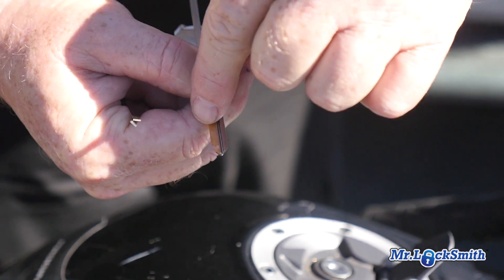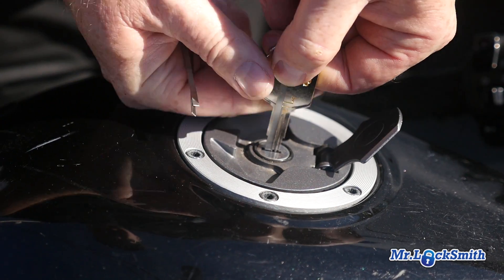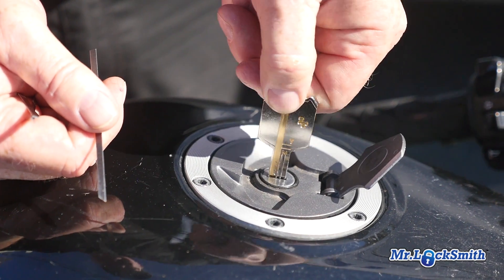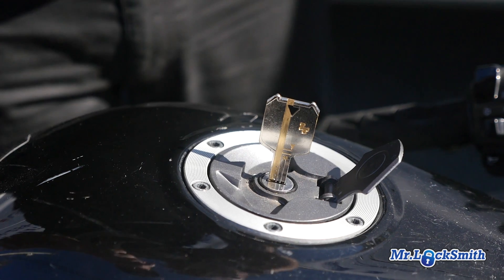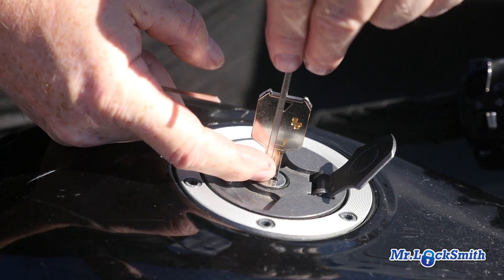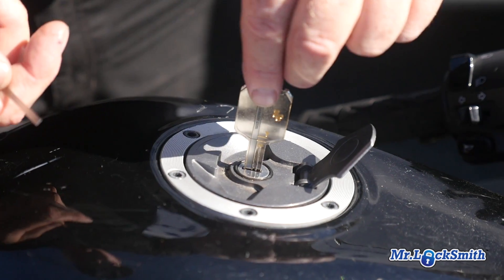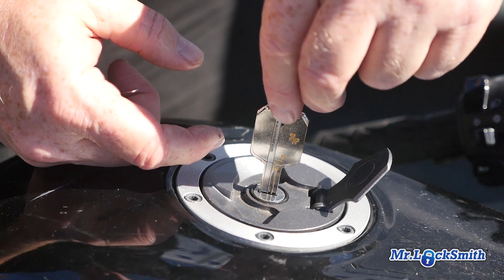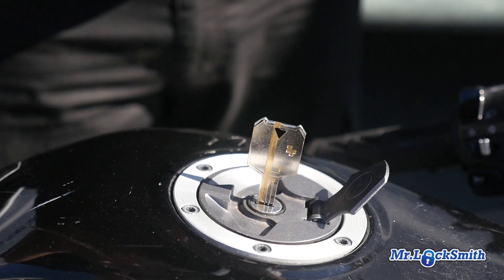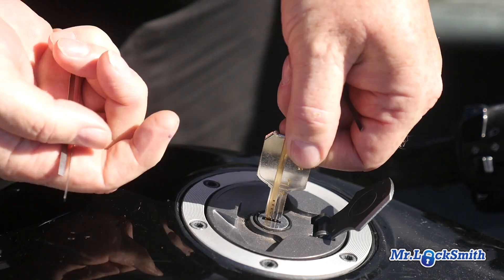You put the slide tool in so that it doesn't trap wafers too soon. Put it all the way in, move it and shake it so that you release the wafer — the wafer goes into that slot. Then you start measuring. Start with a three: the three lines up with the N, the no. Put the two in: the two lines up with the N, the no. So you know that depth is a one. Then you put in your slide tool, move it up one wafer, and lock it in.